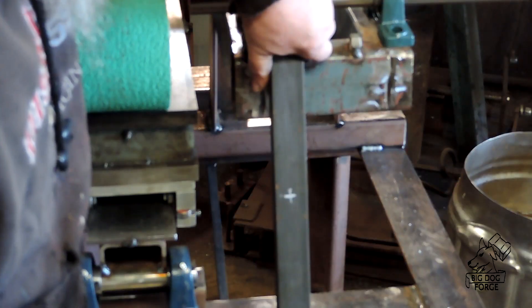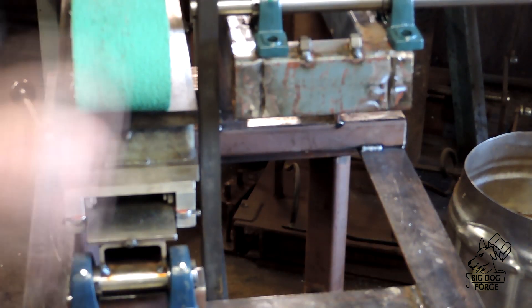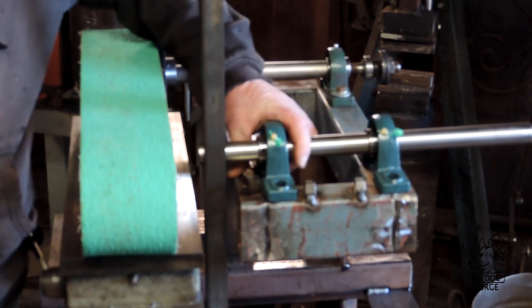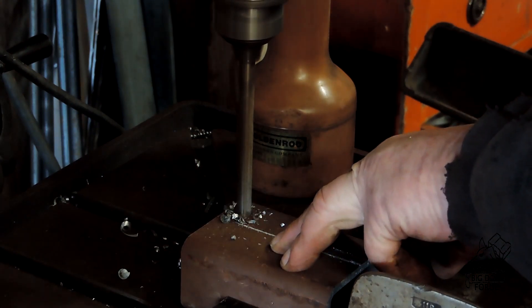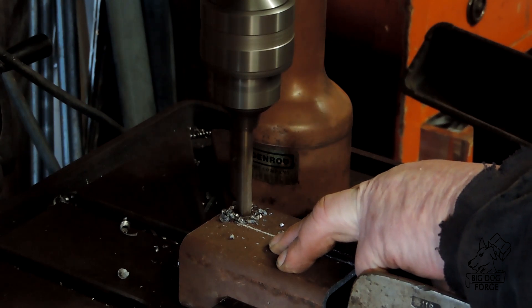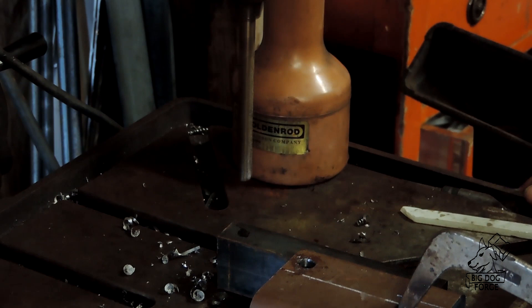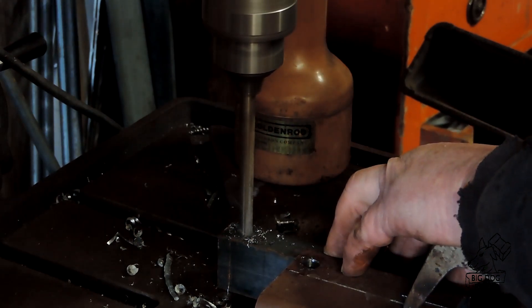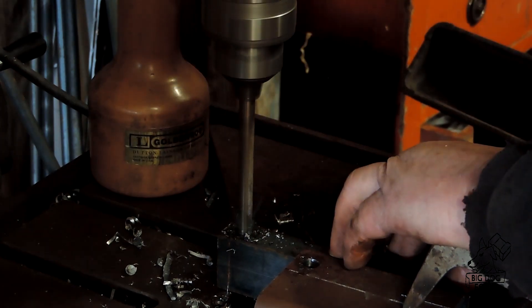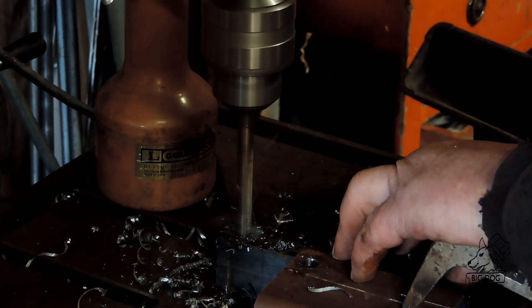We're going to set the idler hub aside and start working on our tension arm. We needed to poke a hole in that piece of steel — these two pillow block bearings are going to support another one inch stainless steel shaft, but they didn't have a one inch drill. We're going to offset that wheel towards the back to take up a little more of the slack, and these are going to be the tracking parts for tracking the belt back and forth. We're going to pretty much replicate what I built on the 2x72 belt grinder as a tracking mechanism — they seem to be pretty stable and work really well.